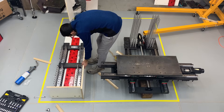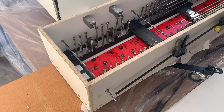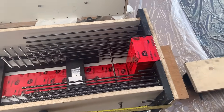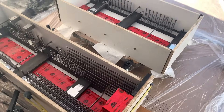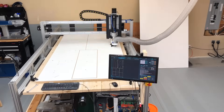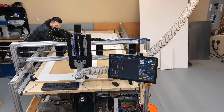After lunch we placed the steel frame inside some melamine molds that we made, and we're now going to fill these molds with epoxy granite to give us the strong and heavy machine base that we want. In order to make these molds we actually spent a week building a CNC router — if you want to see how you can quickly build your own, watch our CNC router video; the link is in the description below.